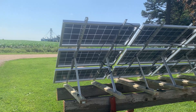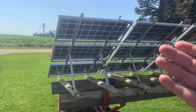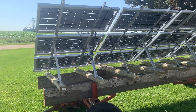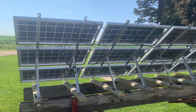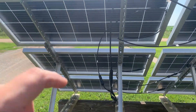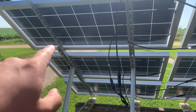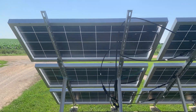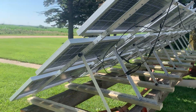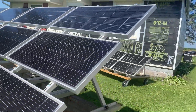The gaps — I could have modified the brackets a little bit and tried to get rid of them, but with these being bifacial I'm letting light through to bounce back. Also with wind, it's less of a wind catch when there's that break. Each set is three bifacials, one 45-inch bracket, and then half of another 45-inch bracket. So you're going to need one and a half 45-inch brackets per setup like this if you were to replicate what I did.